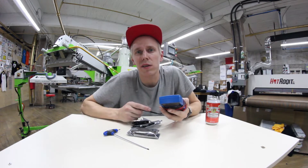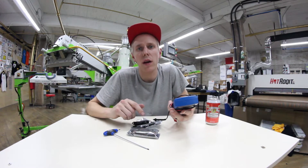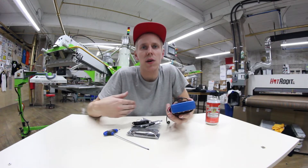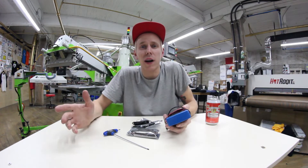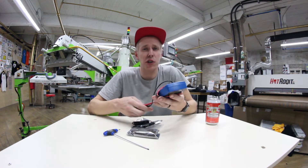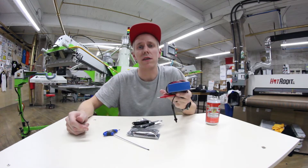I've replaced these lasers like five times and no one ever thought to ask me to check the voltage. It turns out that the technician who installed my press had wired it wrong and was sending a higher voltage to the lasers, burning them out in like a week or two. We went down that road for a little while before we thought about checking how they were hooked up. So I urge you to get a multimeter — they're super cheap and it's helped me with other problems in the shop as well. Watch for a good sale and get this on your list.